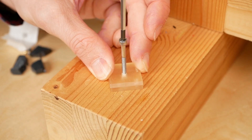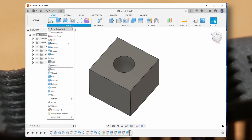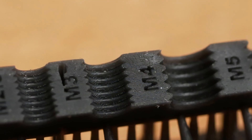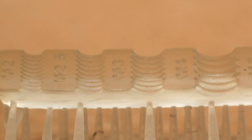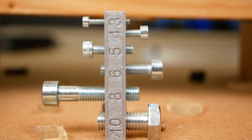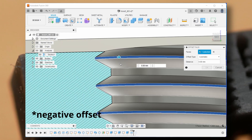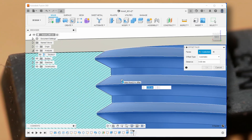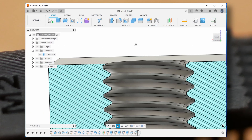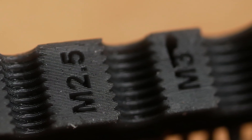First, you can simply screw into a slightly undersized hole. Then you can tap a hole like you would a metal part. You can also directly model the threads in CAD — even the small M3 threads I used for this test are in no way a problem to reproduce on an MSLA resin 3D printer, and even FDM printers are able to achieve more than you might think. The only thing I usually do is add an additional offset in Fusion 360 on the threads to allow for a bit of tolerance — for M3, this is usually around 0.05 mm, but varies depending on the resin, printing orientation, and how easily you can wash the uncured resin out of the hole.